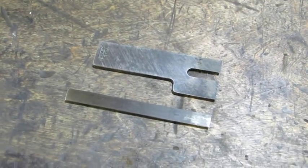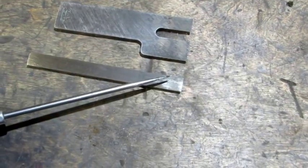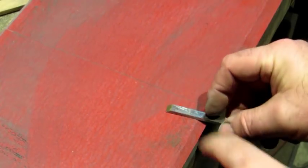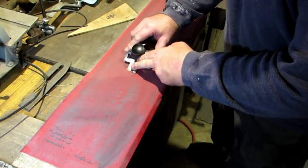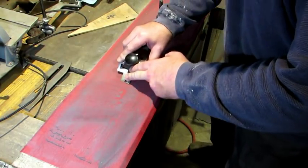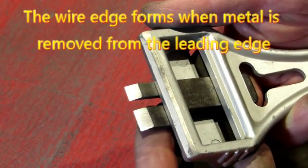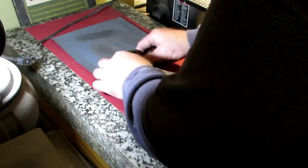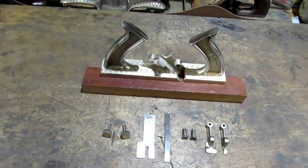Next I want to sharpen the irons. Just like a regular plane iron, the back sides are important. You want to make sure that the areas at the leading edge are perfectly flat — I do that on my lapping station. With the backs flat, both irons go on my General number 810 plane and chisel sharpener at about a 30 degree angle. I can see and feel the wire edge that runs all the way across the front of the iron, so I know that I've got it sharpened properly. I'll finish the sharpening on both irons using 1000 grit paper. The irons are sharp, all the small parts are clean — it's time to put this old girl back together.